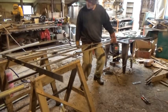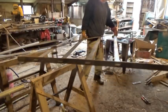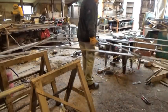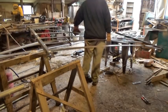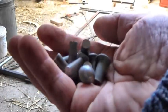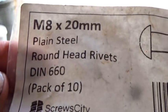Only the ends are welded; that left all the places where the bars crossed over each other. Rivets is the traditional way of joining steel when it's in layers like this. I've never used them before, so this was a total experiment. These ones are small enough so they won't need heating. The idea is that you just bash the end until it spreads out like a wedge, and then you round it over like a mushroom head.